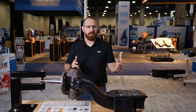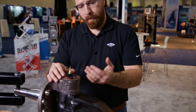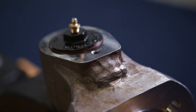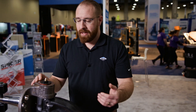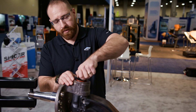Now that we've looked at the drawers and our kingpin kits, let's go ahead and take this apart. This steer knuckle assembly right off the bat has a knuckle cap — we have an upper and a lower — and in that knuckle cap we have a zerk fitting. These zerk fittings need to be lubricated independently, meaning that you can't just lube the top one and hope that it gets to the bottom. That's not going to happen. You need to make sure you're servicing the upper knuckle and the lower half of the knuckle as well. So let's take these caps off.